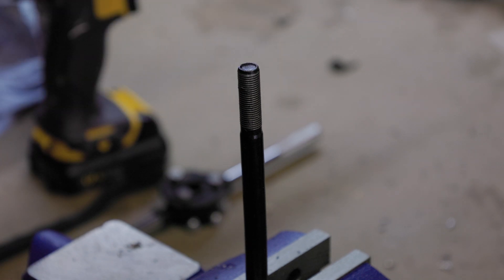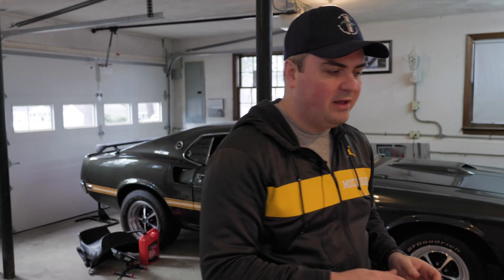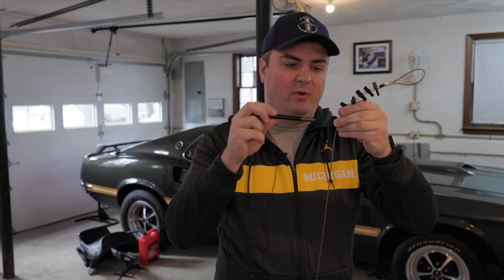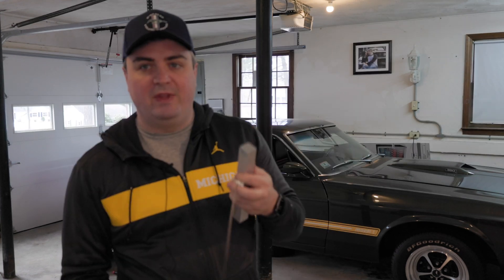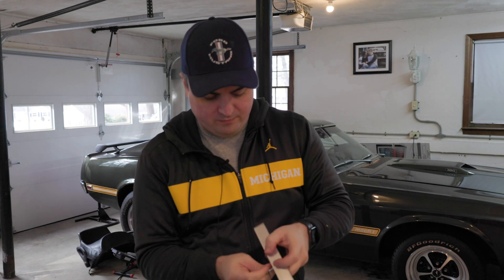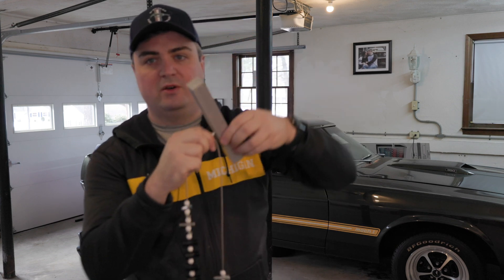So this is fully tapped. Now let's go ahead and try both of these. We'll check both the tapped block and this bolt to make sure they were threaded correctly. We're going to take the thread gauge tool we had earlier — you can use a bolt for this as well if you have the right size — and take the M10 screw, find the M10-1.0 slot, and screw it in. It screws in nicely because the threads are clean and never been used before. So we know the M10 is good. Next we check the block using a quarter-20, and you can see it goes on nice and smoothly.